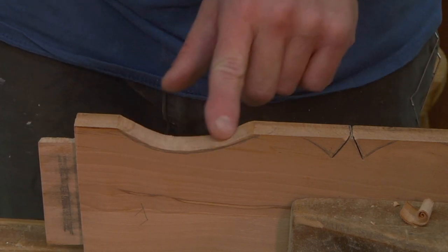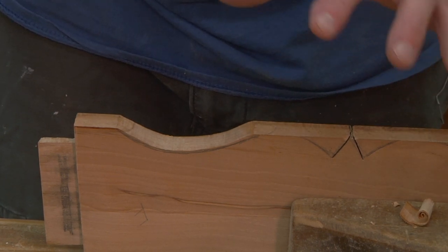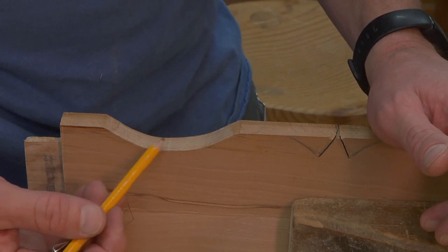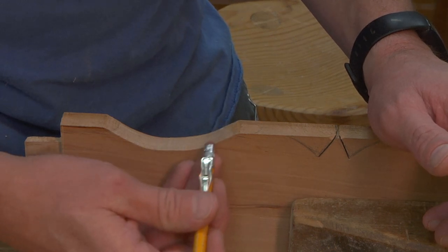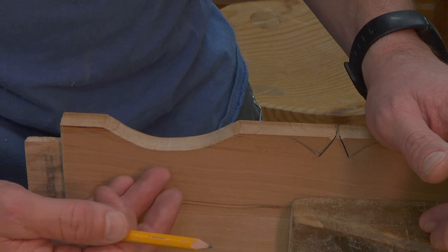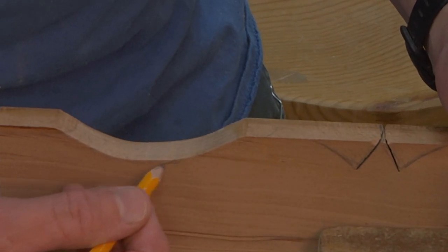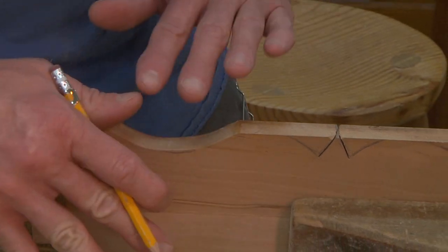I have a little bit to go — you can still see my pencil line but the shape is looking nice. I spent a little bit more time smoothing it out and digging down into it. I thought I had it perfect down to my pencil line, but I suggest you erase any remains of your pencil line — that will reveal the true shape. Your eye gets fooled into looking at the curve of the pencil line versus the actual curve of the wood. Right in this area here it looks a little flat, so I'm gonna go back and scoop some of that out.